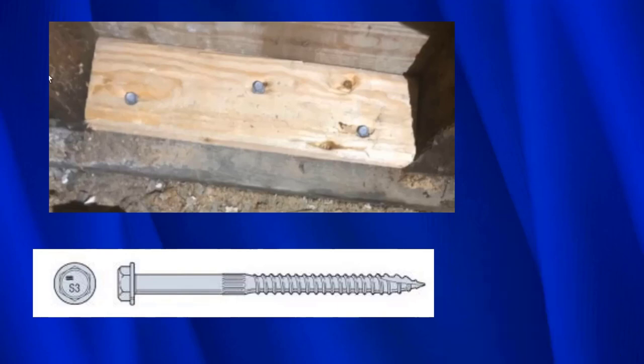So the way these work is, these are usually 3 inches long. So let me show you what this actually signifies. Sometimes it's hard to tell when you're looking at these pictures what's here. So this is a stud, the bottom of a stud. Then you come over here and you would be 16 inches on center over here to this stud. And then in between here, the distance is going to be 14 to 14 and a half inches. And that's what this block is. This block is 14 inches.